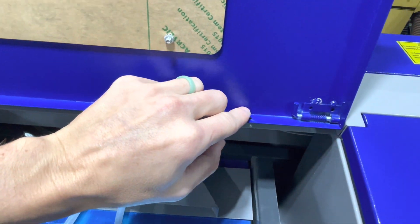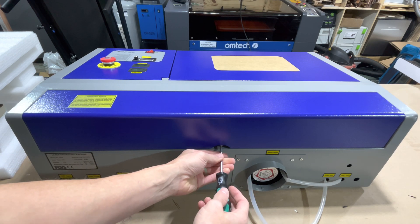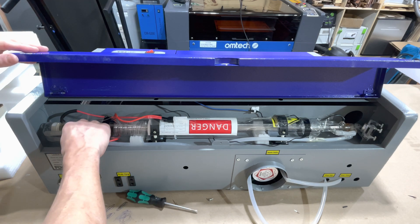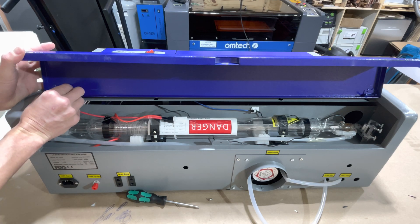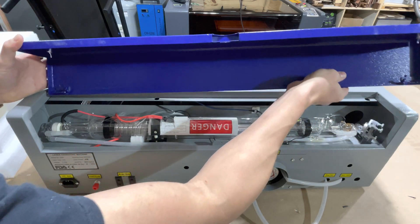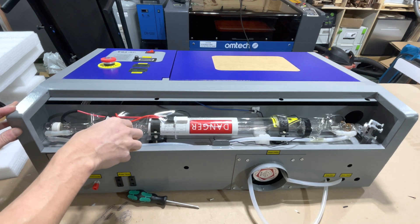I'm showing you those spring-loaded latches on the doors. You just pull it back and your whole top door comes off. The door for the laser tube on the back comes off as well, so you don't have to worry about it slamming shut while you're working on it. To open the back for the laser tube, you do have to take out one Phillips screw, then you have easy access to your laser tube in the back. Now I'm inspecting it — it's been really cold where I live, in the 20s and below. I was worried they had tested this at the factory and that there'd been water in it. There does look to be a little bit of condensation still left in the tube, but I have not seen any damaged areas. When we get this thing fired up in the next video, I'll definitely look for leaks and cracks in this tube.